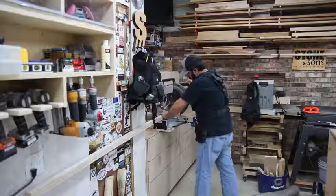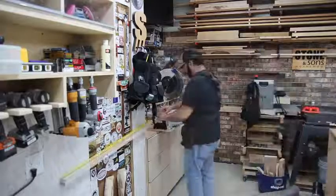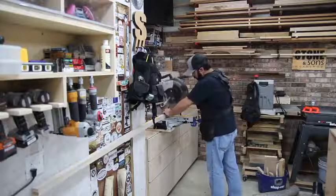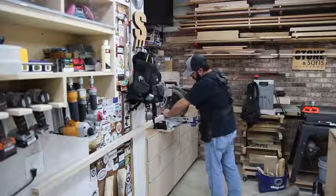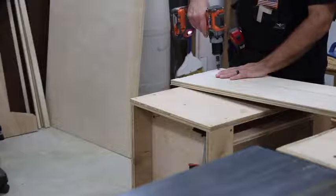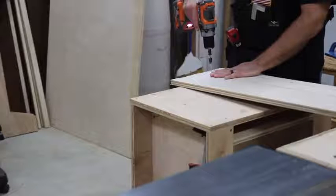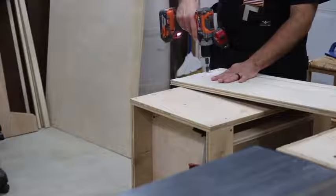With this particular style I'm making the four outside pieces — the two ends and the two sides — but there's gonna be some internal parts to this as well. I've already cut down on the table saw a bunch of strips of plywood and I'm cutting them to length here. This is going to create an internal section of the bed underneath for support — kind of where the slats would go, but they'll all be installed beforehand, and then there'll be a panel to go on top.